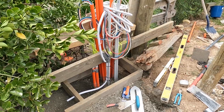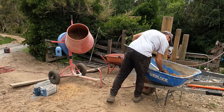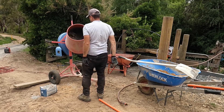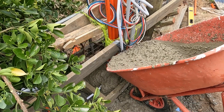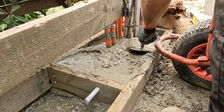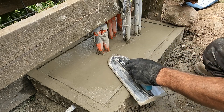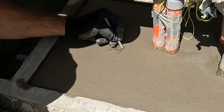Here are my cables going to the main meter board, and you can see the main driveway is also backfilled at this point. I mix up some concrete and need to make a plinth for my main meter board to rest on. It was quite a hot day so I did a fairly wet mix to give myself a bit of time. You can see the little flexible conduit on the left - that's for the earth wire. There's an earth stake required at the meter board and I'll put that in a bit later. I don't think I'm the best concreter in the world but I took my time, put a nice rounded edge on it, and at the end couldn't help but mark my name in there.